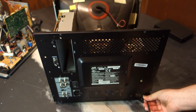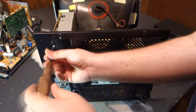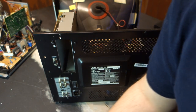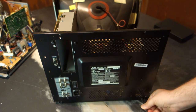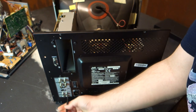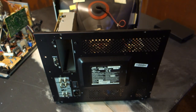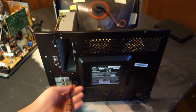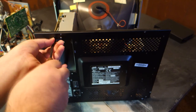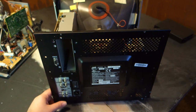Now, we will begin work on the 1950CG, repeating the same general steps that we'd previously performed on the 1900. The screws here would seem to be holding a bit tighter than those on the 1900, which I can only assume is from the rough handling the latter received in shipping. I should have mentioned this earlier, but the screws on the input panel itself do not need to be removed. They're simply there to hold this panel to the daughter board, not to the rear plate.